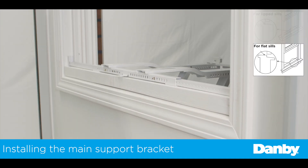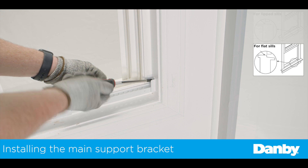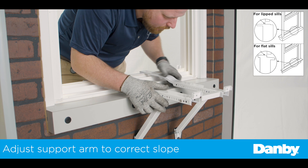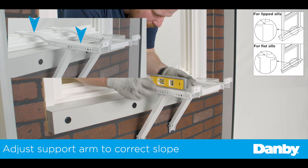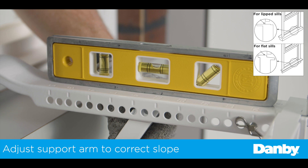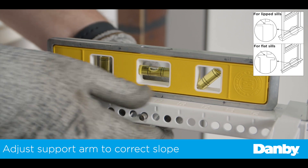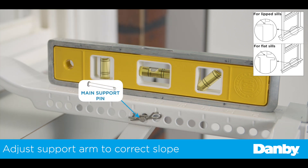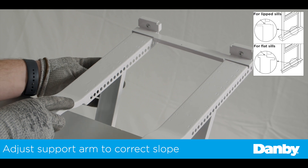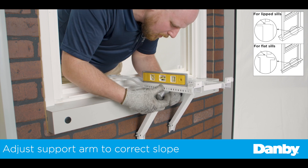If your bracket sits on the window sill, maintain control of the bracket and secure the bracket to the window now. Move the angled support arms until the feet touch the outside of the building. Then place a level on the main supports. Adjust the first angled support arm so the bracket is tilted downward toward the outside — the level should show one quarter bubble for the correct angle. With the first angled support arm set at the correct angle, install the support pin through the closest matching hole along the main support and insert the cotter pin. Using the numbers on the main support, adjust the second angled support arm to match the first. Insert the main support pin and the cotter pin. Double check the level and make any necessary adjustments.